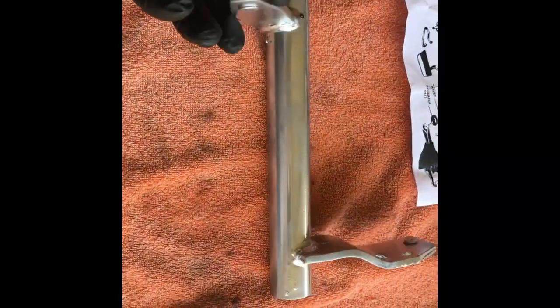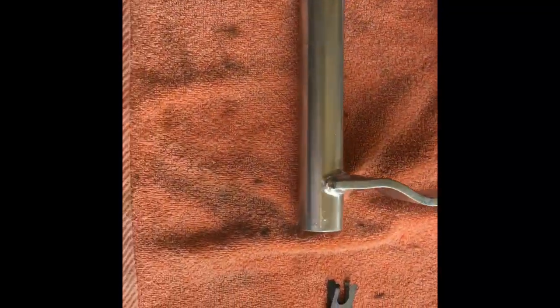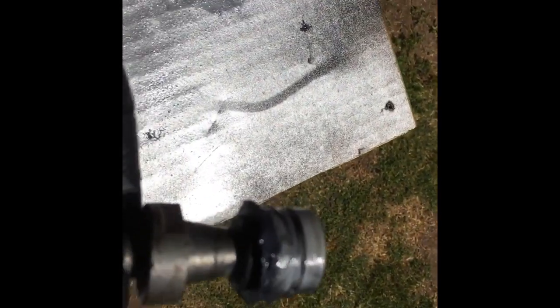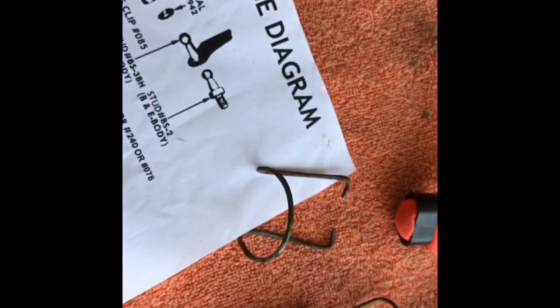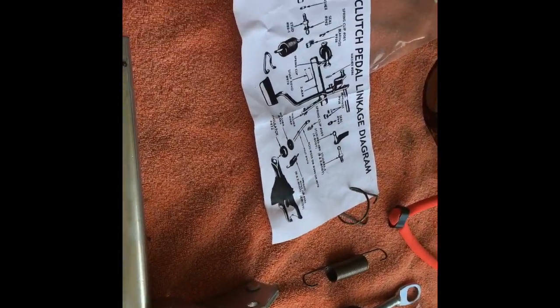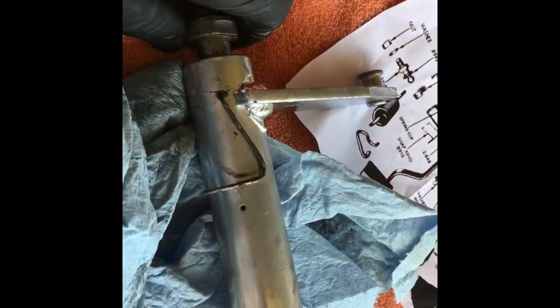The z-bar is painted and lubricated — I put some lubrication in it. Now I'm gonna reassemble it. Here's the one piece that goes in. You'll notice the grooves on the end of the plastic. I've put the Teflon on the end — there's a groove there — and when it goes into those holes, this pin goes through that hole and fits in that groove, which is what holds the Teflon in place.